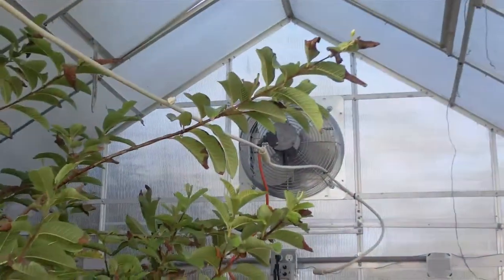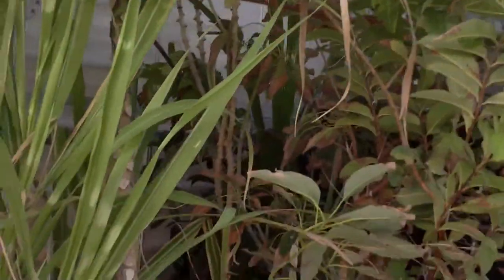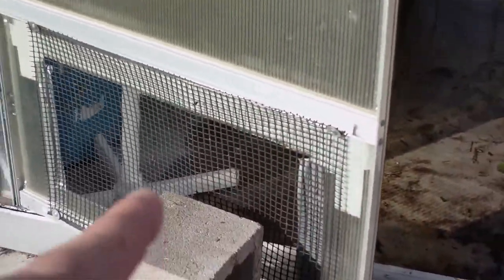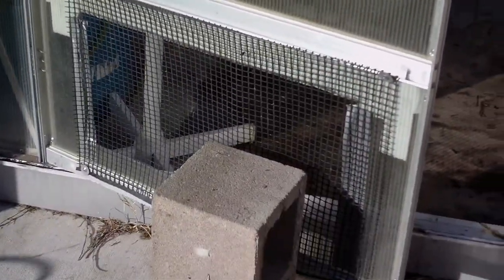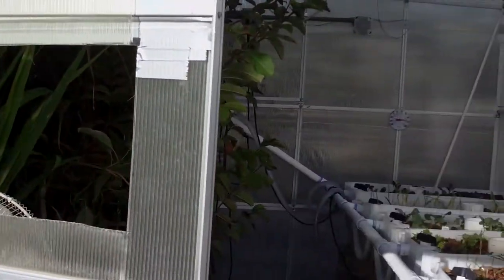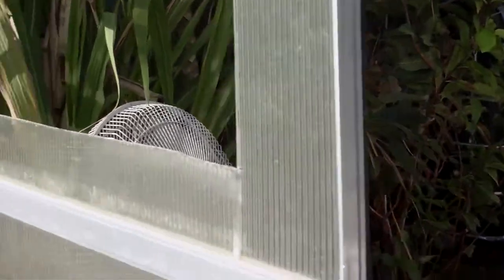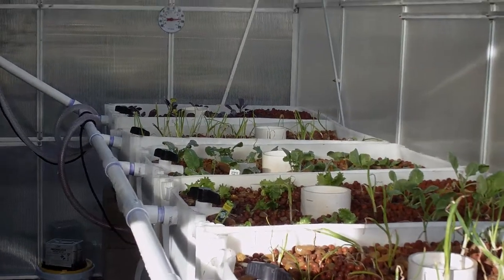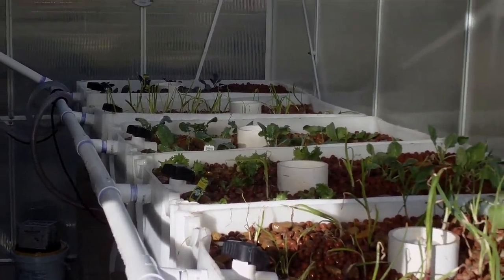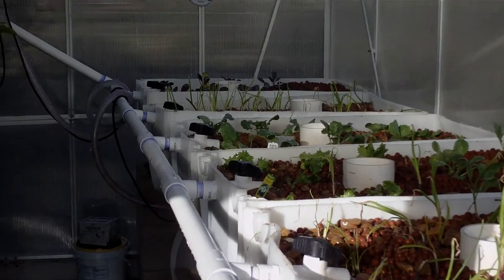If you do something like this, buy the thermostatically controlled fan in the back and do not worry about buying dampers in the front, especially if you live in a hot environment like South Texas. You're probably going to have to cut more holes — we started with one and it was getting way too hot, so we ended up cutting more. Now with the doors closed, when the fan comes on by itself it pulls enough air to keep things steady. Thanks for watching everybody — we'll do another update in a week or so as things develop. God bless you and thanks for watching.